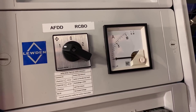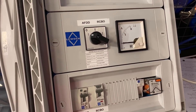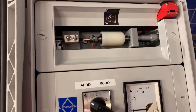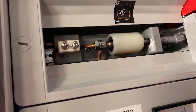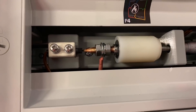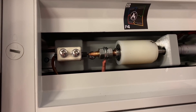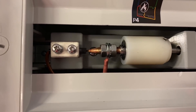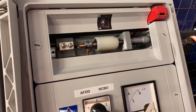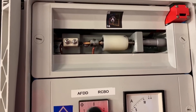Is there a minimum current that needs to be seen through the AFDD for it to operate? Yes — the EN 62606 standard stipulates a minimum of two and a half amps in order for the AFDD element to work. And at the top here, this is the clever bit: this is a carbon graphite rod on the left-hand side, and we've got a copper rod here, and we're able to adjust the gap between those finely in order to create and draw out an arc. That's probably what's not happening when people create their own at home — they're going copper to copper. The standard stipulates a graphite rod and a copper rod.